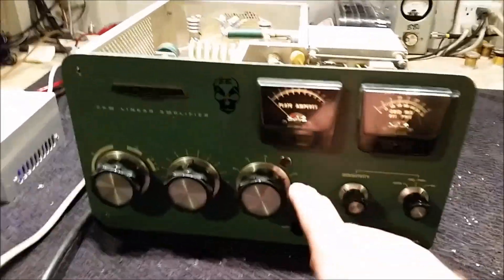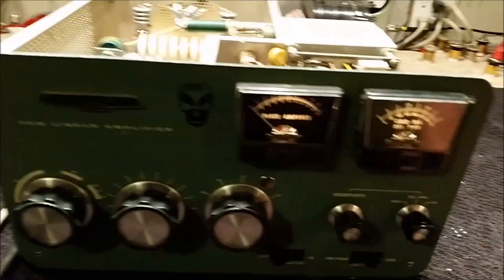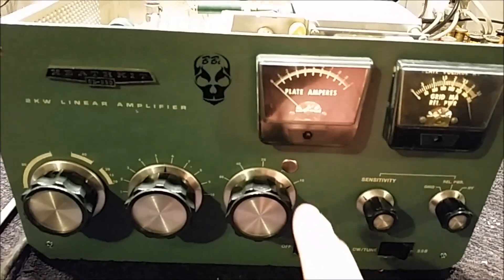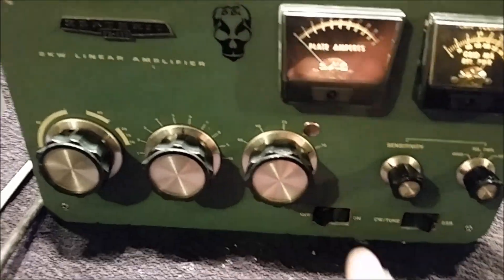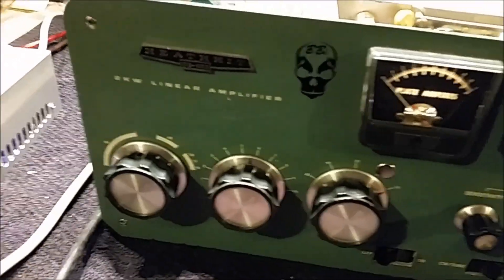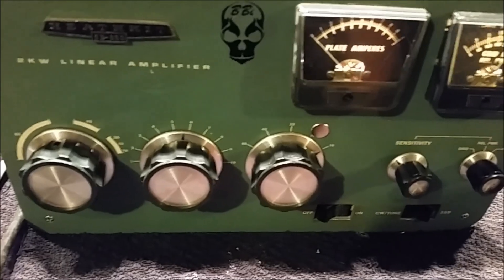The other mod I did is I made sure to punch a hole right here for you. You pop this plate out, and you'll be able to go in here with an Allen wrench — and by the way, use a non-conductive one — and adjust your input tune. That's all there is to it.